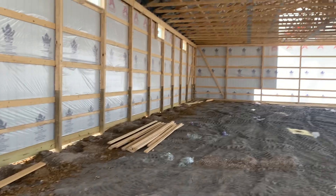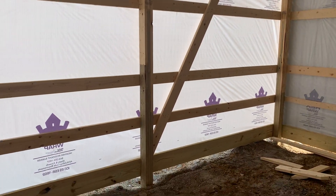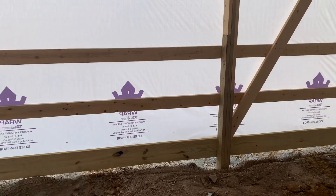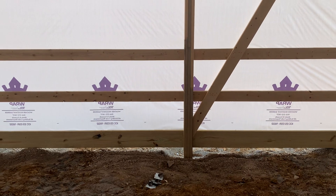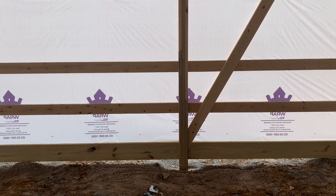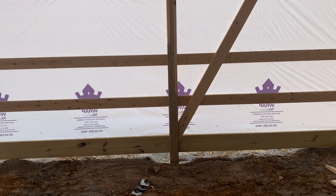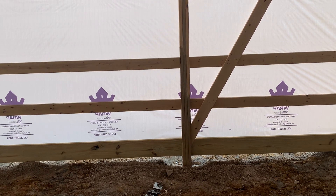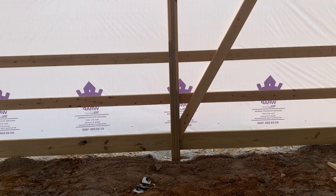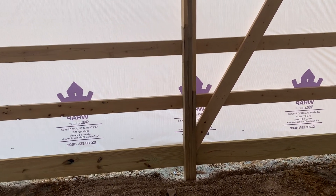As you can see, these guys are on the backside putting up the steel. But the cost difference — for example, on this building, a 60x100, we're going to use a 3-ply. And according to Purdue University, a pretty top-notch engineering school, a 3-ply is 30% stronger than a 6x6. I was just looking at the numbers, and a 3-ply laminated column is 11% more, as of today, than a 6x6 solid core CCA post. And a 6x6 would be 30% more than a 4x6.